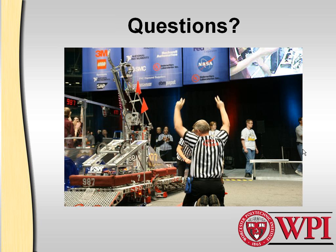You said the wheels should be able to spin when you're stopped against the wall. Does that still apply on a fan drive? Yes, it does. Any time that you apply full throttle or voltage to a motor and it's not going to turn, one or two things can happen. It's either going to overheat the motor dramatically or it's going to pop circuit breakers, neither of which is desirable. It really just means you have too much traction or too high of gearing. I don't care what kind of driveline you have, whether it's crawler tread, four-wheel drive, mecanum, or swerve drive, if you can't spin the wheels, you should really reconsider.